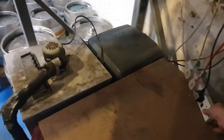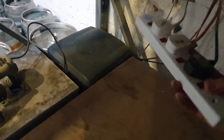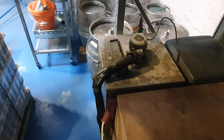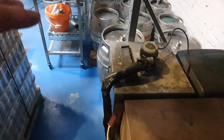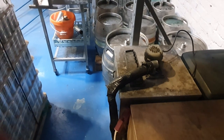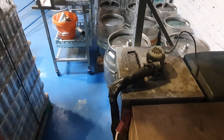We're going to turn on the chiller for fermenters four and five. What that's going to do is get the unit down to temperature so when we put the beer in, we've already got a cold bank of glycol in case we need to do a little bit of extra chilling in the tank. Because the cooling water going through the plate chiller in summertime is sometimes not quite cold enough.